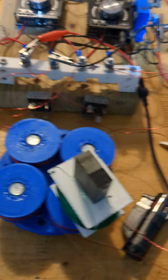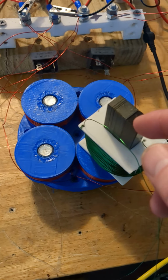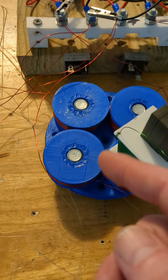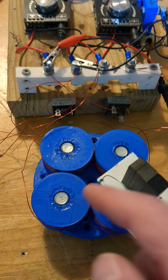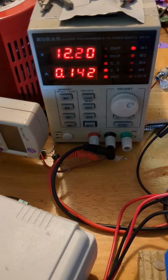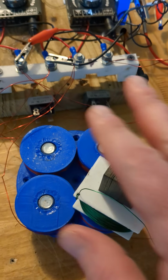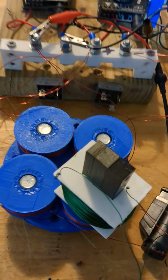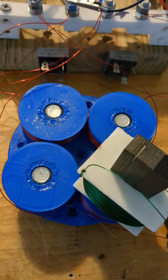This is just another way because I'm trying to work out the back EMF problem. So currently when it's rotating, when you raise the frequency, the output starts going up, but then the input keeps going down, which is fighting against me. I can't let that input go down. This is running off 2 supplies. Okay, because I'm isolated 2 phases in here connected together. But the isolation in this method is important. I was hoping this would do something advantageous to my back EMF issues, but unfortunately it's still experiencing that, because